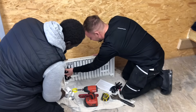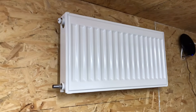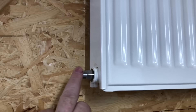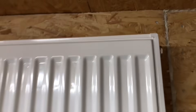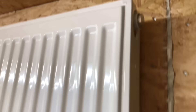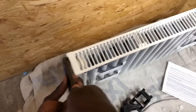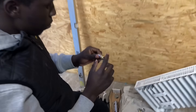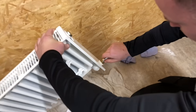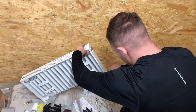So we've done this radiator, we've put this one on the wall. We've put the tails in, and we've put the bleed point in, and also the blanking cap on this one here. We're just taking the plastic bits out of the ends now. We've just got to start putting a bit of Loctite on the thread, and Danny's just going to screw this one in using the Loctite 577.